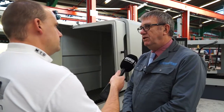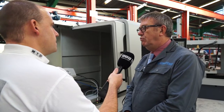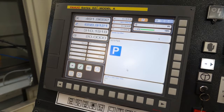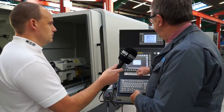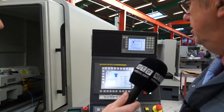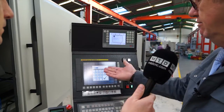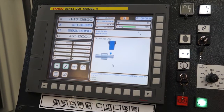Control's a big factor. Are you programming offline on something like this, or are you doing it at the control? You tend to do it at the control — we can do it offline, but we use a digitized system where the operator will manually touch on and just record the position. The control itself is a FANUC control touchscreen, the latest control that we have. The operator can see his program and work his way through. Dead straight forward — just touch it, fill in the data that you want, proceed through to the end, save it, and that's done. And that can be done while the machine's operating.